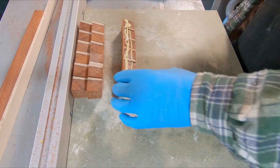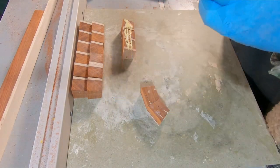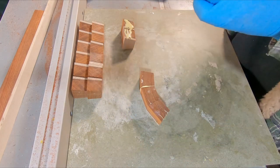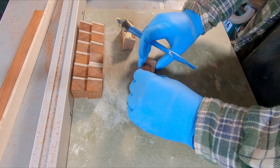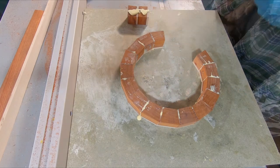There are a total of 11 rings and a solid base piece. They will be glued up in three separate sections: base, middle and top. I did this so I can get to the inside — if all the rings are glued together as one, it would be very difficult to form the inside face.